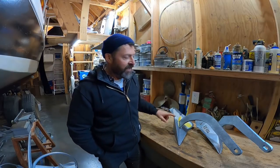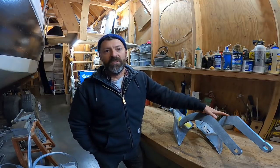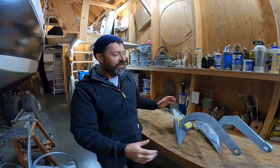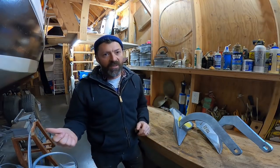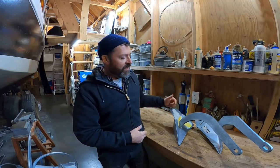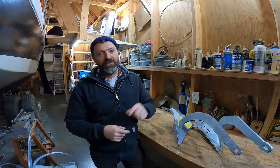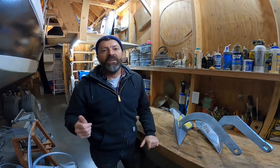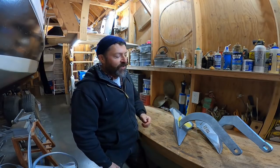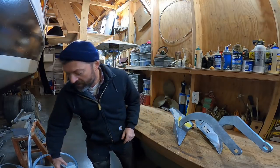Now, I already owned a 21-pound Spade and a 17-pound Excel, and we saw those in the rope rode. But I needed a couple more anchors to sort of round out the field here. As you saw in that previous test, I made the observation that the non-roll bar, thick fluked anchors worked much better than the thin fluked roll bar anchors in that sandy mud seabed. But I don't have any of those roll bar thin fluked anchors in this test until now.